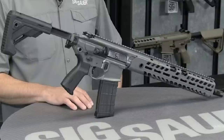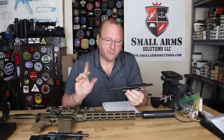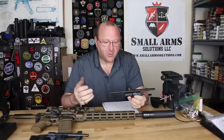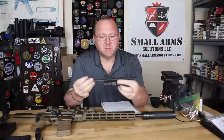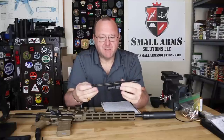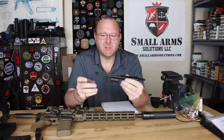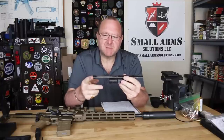Now the bolt carrier group, the modifications that you saw with the voluntary upgrade was there. So you would have the new bolt carrier group. The most important aspect of that was the firing pin safety. So I want to take a close look at the firing pin safety. Now this particular one here, you're able to disassemble like you did the original one. This had all the modifications with the exception of the pinned base plate on here.